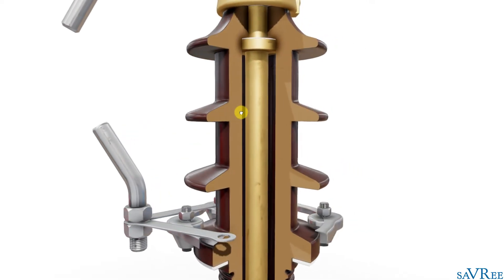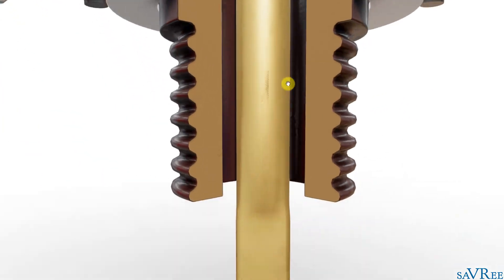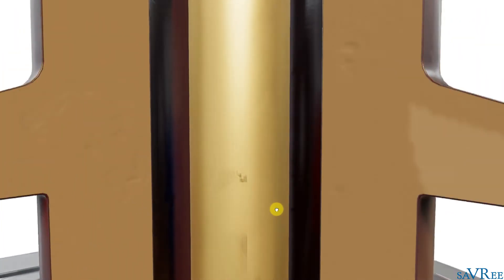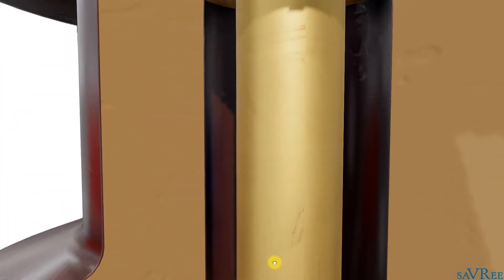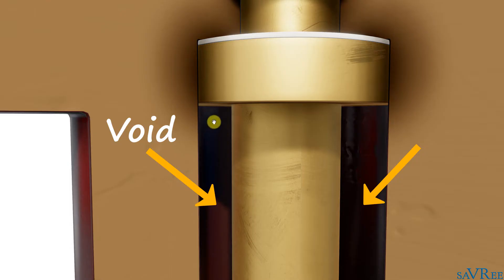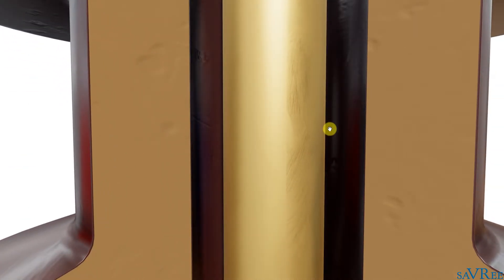To the side of the conductor, we've got a void space. You can see the void actually starts at the bottom and runs all around the conductor, coming all the way up. This void space on both sides is full of mineral oil — we actually call it electrical grade mineral oil — and we use it as an insulator. I'll come back to that in a moment.